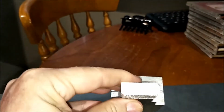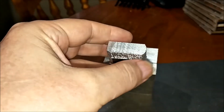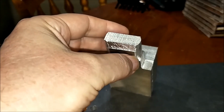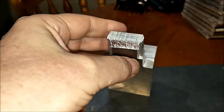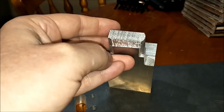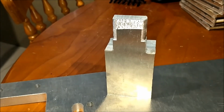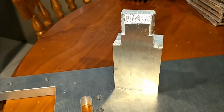which is why it hooked into this, because the start point where the cycle starts is over about here. So it went down to 10 below this point, but it was still 5 above the 0 point. So came down to there, and as you saw, went straight across to here to the start point. What I should have done is probably to set the feed plane higher, or maybe put a retract in there or something like that. But of course that means going back to the G code, refixing all that back up again, putting it back onto a USB stick to then transfer it over to the machine that I was working on. And I was just purely being lazy, and this is the result.